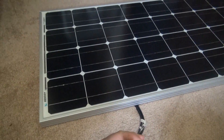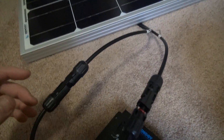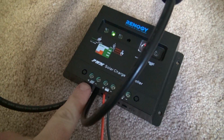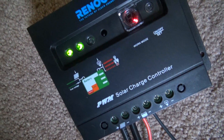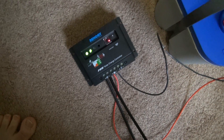Now the next thing to do is take the long leads on our panel. I'm going to flip this panel over so that it's catching a little bit of light. I'm indoors, so it's not going to take a lot of light, but that's okay — we're just doing a test here. Now we're going to connect these pigtails from the panel to the pigtails on our charge controller. I've got the positive side connected. As you hook these up, double check that your positive lead on your panel is indeed going to the positive wire on your controller — very important you don't get those backwards; you can damage your controller if you do. I picked the panel up and pointed it towards the window, and as soon as I got it closer to the sunlight coming in the window, my green light came on. So now it shows that it is indeed charging the battery. We know our panel works and our charge controller works.